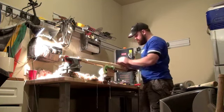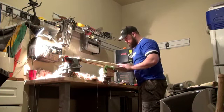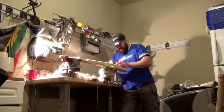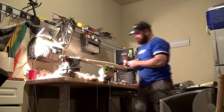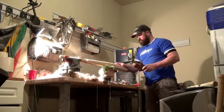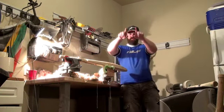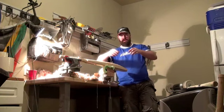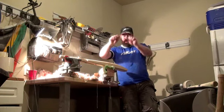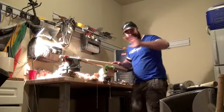I'm going to drop my toe down, and this is a little bit scratchy, not the best way of going about it. You should use the knife a little bit more, but where I want the duck, which is that little bit of a fall off, I just want to cheat, and I want to take these little pieces. If I just took straight away from the wood and come down with a knife, I've got these little kidney areas, and what I want to do is thin those out, and I'll use the round bottom plane and the heel shave just to take a little bit more out.